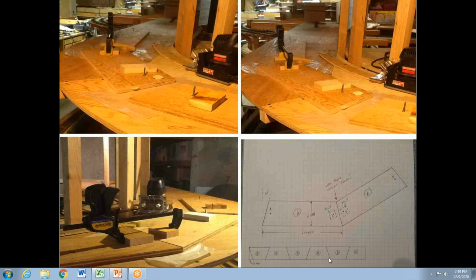You cut your first 15-degree. If you're building a helix and you're going to make 50 of these, it'd be better to set up a stop for your length, so you can just slide the plywood in, cut, flip it over, slide it in, cut, flip, and just keep on going for as many as you need. The leftover piece on the end, I would use to attach to the rest of the layout. Or you could just cut a 15-degree and scrap the rest. It's up to you.